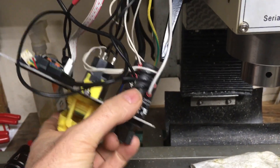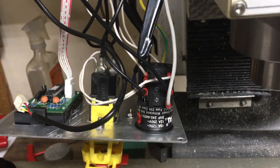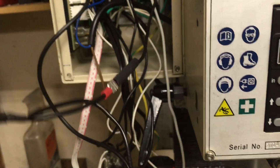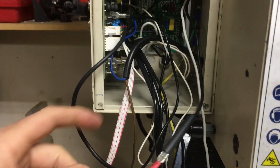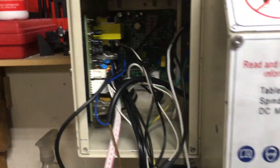I can pull the white wire out of there, unhook my connector, and then pull the motor wires out through the small hole up in there — it comes out up here and then the motor is free. Otherwise, you're kind of dangling from the motor wires, which is not good. I did not install this back where it was. Since I had it clipped and was able to undo that other wire from the switch, I just pulled it clear out the backside, put some tape over that hole, and now I just leave this thing dangling loose inside the box. So if I have a fuse issue, I'll pull the front panel off — it's way easier to pull the four screws out of this panel to get in there and look at that fuse. I thought about drilling a hole out the bottom and remounting it externally, but it's not a big deal. I've never had a fuse problem on this thing, and it's so easy to take that panel off if I need to.